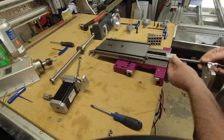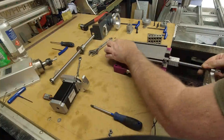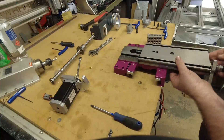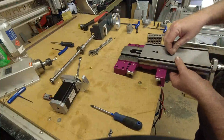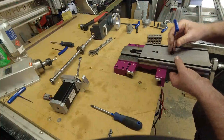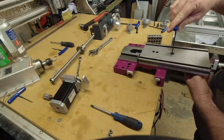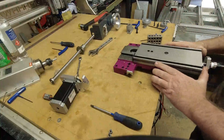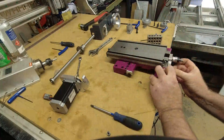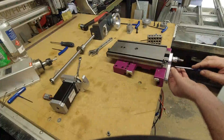To get these in, it's very tight through here — there's not a lot of room, about a millimeter clearance each way, if that. So to get it on, first bring the carriage right out, get the nut box started, and loosely do it up. We don't want too much tension — we need movement to be able to align everything first. Gently slide it back and get our motor mount plate, then loosely fit that.